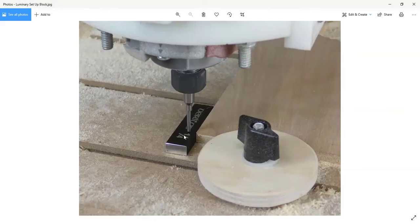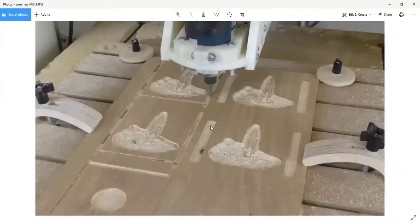So if I use a setup block and everything's programmed off of that 1/4 inch setup block, then all of the thicknesses, the material left behind is what's important, and that's what I can control. Normally, if I need a pocket of a given depth, I touch off the top of the material and the pocket will cut to exactly the depth I need. But in this case, I wanted to leave stuff behind.